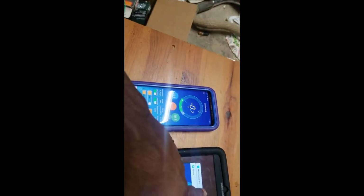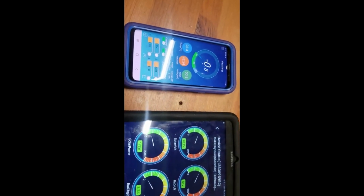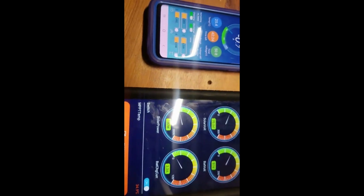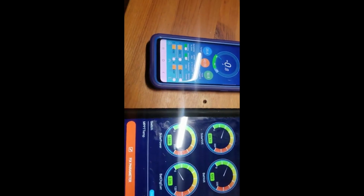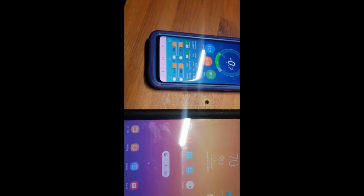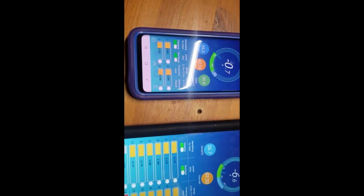All right, folks. Now let's see where we are. Let's see if we got any charges. I'm producing 3 amps. It's cloudy out there outside. Yeah, 160, 170, 103. I'm producing 3 amps. So I'm good. So hopefully during the day this thing will be filled up at 4.4. So in other words, I lost 4 volt from the night before. I left the AC on and let everything on.